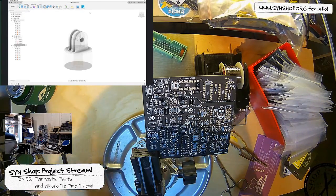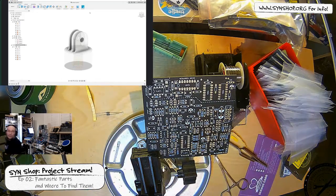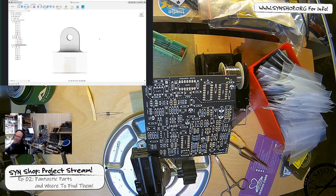Is how I'm going to design the next part of the component. So this piece is easy, because it just screws onto a 1/4-20 screw. Right. The next part, the camera has a 1/4-20 hole in it, so I have to figure out a way of embedding a nut in it. But that nut is going to be in line with all of this. I have a way to do it. I don't know if you're going to like it, but it's a way.